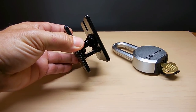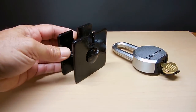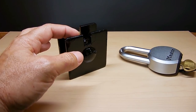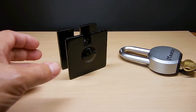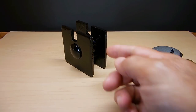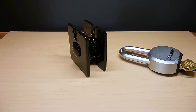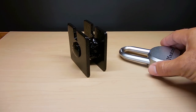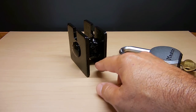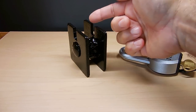On the very bottom you can see there's a steel plate of the same thickness, and it serves two purposes. Once the padlock is in position and up against this base, it's going to ensure that the top part of the shackle is kept low enough so there's no chance any cutter can hit it from the top. It's also going to make it extremely difficult for anyone to try and get a cutoff wheel inside here to cut that center bolt, which is two inches in. If you're using a four-inch cutoff wheel it's going to be difficult because the body of the padlock is going to be right down here with no extra play.